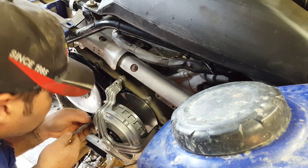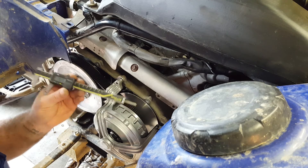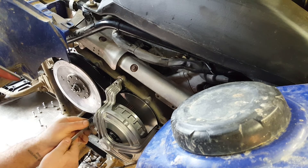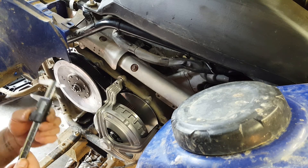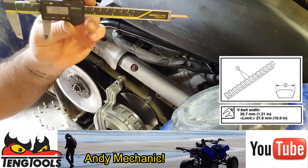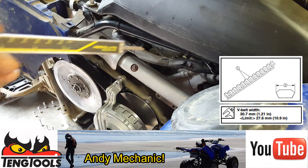So I can do it across the bottom — there's just enough room to get in. Take a measurement and lift it out. Brand new, it's 30.7 millimeters. And I've got a measurement of 29.51. We'll do a second measurement just to be on the safe side — slide that in. Yeah, 29.5. And the minimum permissible is 27.6. So we're about a third worn. We've lost about a millimeter, and we've got about two millimeters left to go. The belt's a third worn and it's done 217 hours.